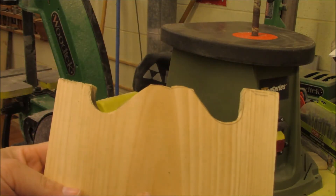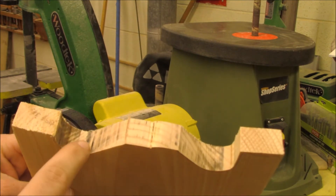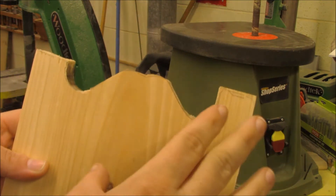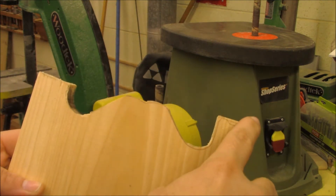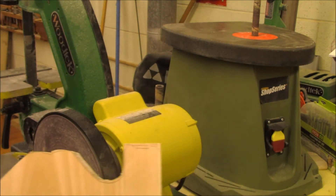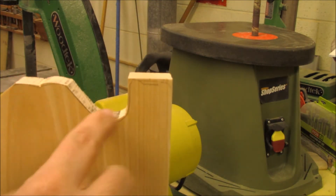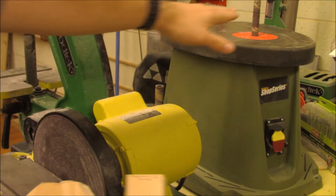Here I have the front of one of our middle school projects. It was cut out on the bandsaw. The blade is not very sharp — it did a little bit of burning — so I want to clean this up. These flat areas and the external curves I'm going to sand using the strip sander over here. The interior curves I'm going to sand using the spindle sander.